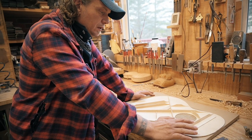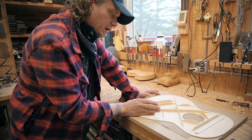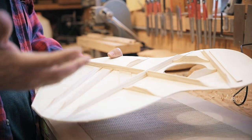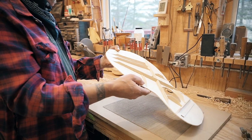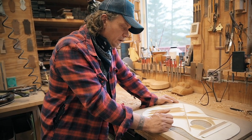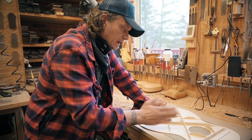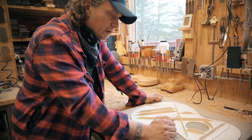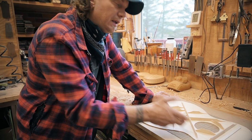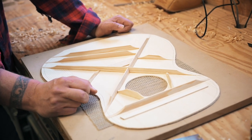The thickness of the top, the braces — how thin they're carved, how tall and wide they are — all make a difference in tone. Some braces are thicker and lower, some are taller and skinnier. I like them skinnier and taller. You're basically loosening and tightening the top. You make a judgment call on whether it's too stiff or too loose, starting from what you cut on the table saw, then loosening it up with a chisel. That comes with experience — building a lot of guitars — and the brace stock itself matters too; some is harder and denser than others.